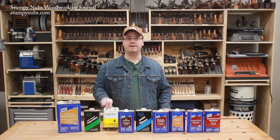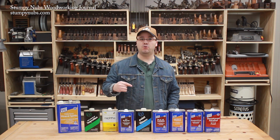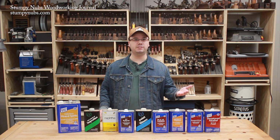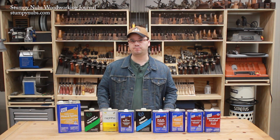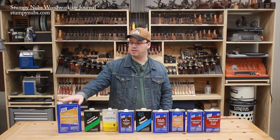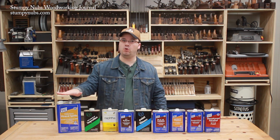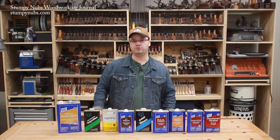Naphtha, for example, evaporates more quickly than, say, mineral spirits, and it's less oily, so it leaves very little film behind. This makes it better for cleaning the packing oil from a new tool, or for removing the resinous buildup from the rollers of an electric planer, or even for wiping down oily woods before finishing. Mineral spirits will do some of these same things, but it may leave behind an undesirable oily film. However, because mineral spirits evaporate more slowly than naphtha, it's better for thinning oil-based finishes because the finish will have more time to level on the wood surface before it dries.